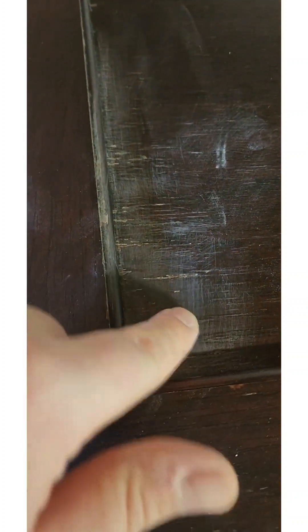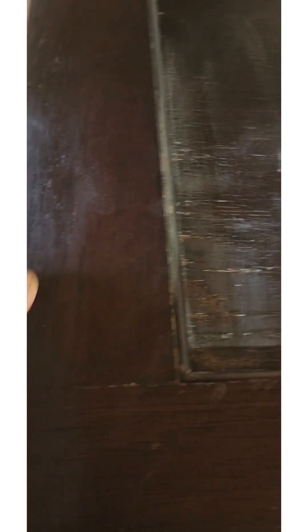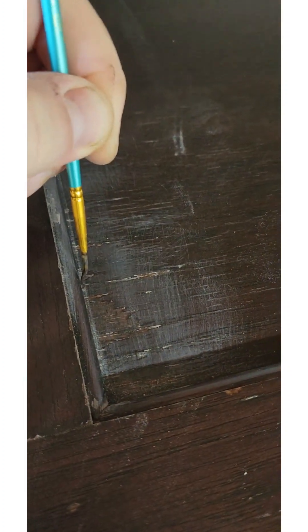This is after I've done a seal coat on the door. You can see where I'm sanding back — the color is a lot better than it was, but we still have a little more work to do. I previously said I'd tone this out, but it's a little jagged and I'm worried the toner won't be even, so I'm going to keep working with the artist brush. I've sanded it smoother and I'm going to give it another coat to even out the color a little better.